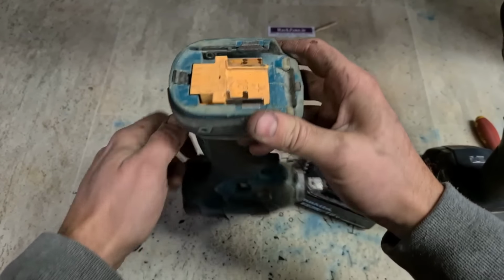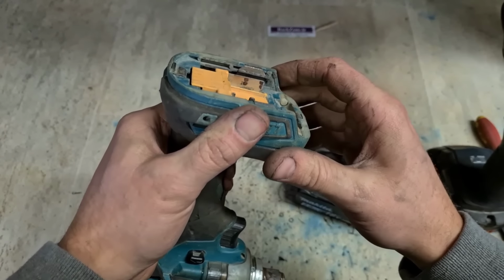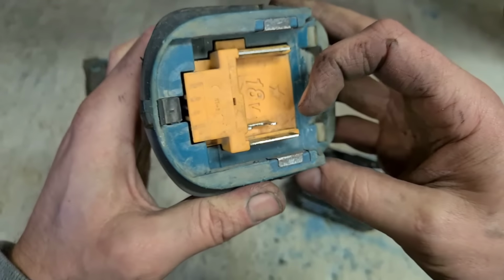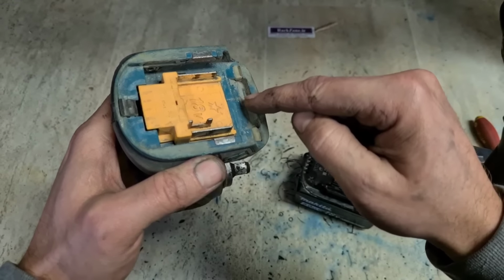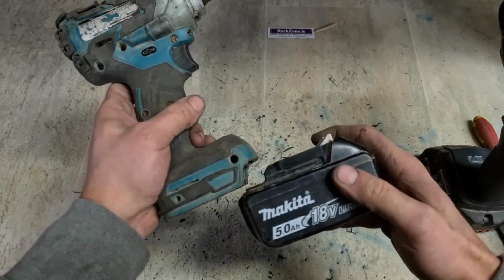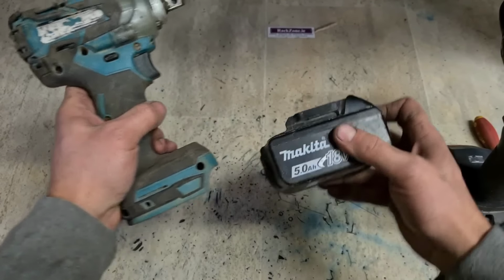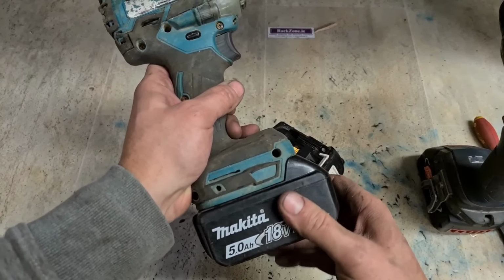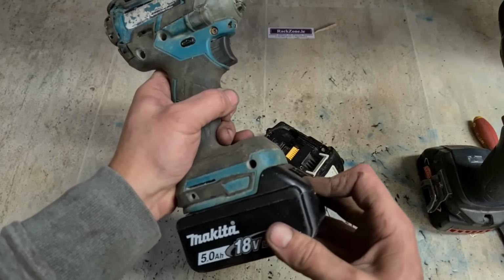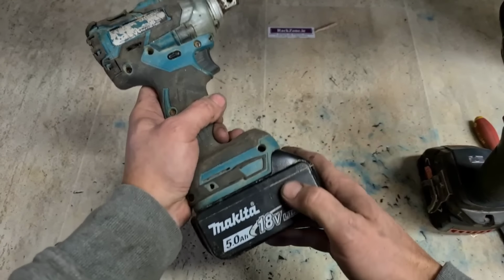And you should get in a fair bit of work because that battery's slack. Don't often get a slack battery in the Makitas. We have steel plates to actually help stop wear, and bushings all over the place to help pack out the battery, keep it nice and tight. She's definitely slack. And it's not the battery, it is the tool. So they do eventually wear out.